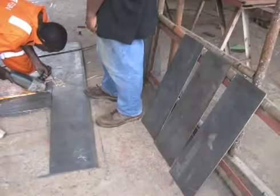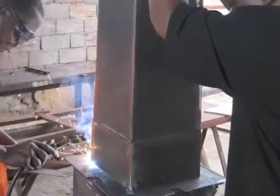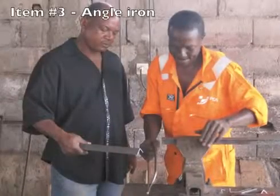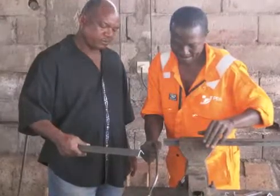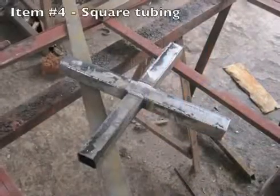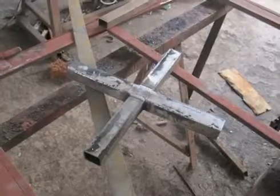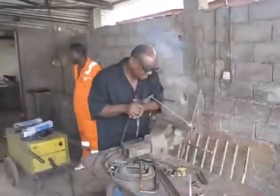Here's a tip: 6mm steel is best for creating the diffuser ledge and a strong base, especially if you are using a diffuser plate and not a diffuser basin. If 6mm steel is unavailable, use 5mm. You will need 1 angle iron, 3,210mm or 127 inches in length. You will also need 1 piece of square tubing, 1,435mm or 56.5 inches in length. If you don't have square tubing, you can weld together 2 pieces of angle iron.